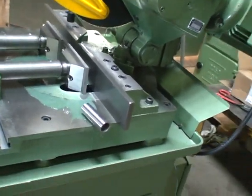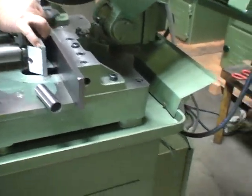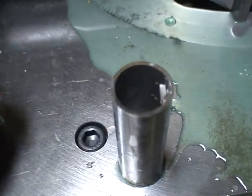The blade's turning at 54 RPM, and it mills through the steel giving you a real clean, accurate finish with very little burr on it. We'll send you the samples back, which you can see in the picture here. It's basically burr-free coming through.